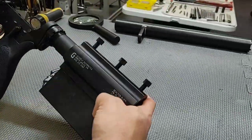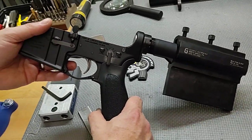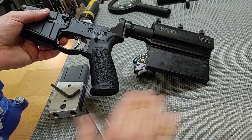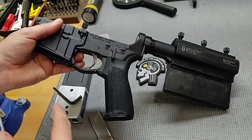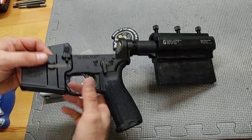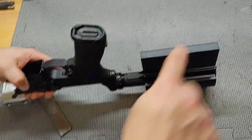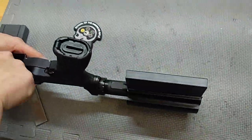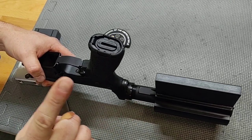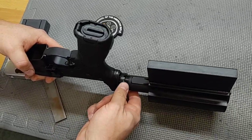The reason that happens — one of my favorite jigs used to be the one made by Present Arms. It's a polymer plate you lay on your workbench with various fixtures for the upper and lower receiver. You put the lower into the fixture, place a plate over your buffer tube, a piece goes in your magwell, and then you tighten the castle nut. In most cases it would prevent the receiver extension from clocking while tightening.